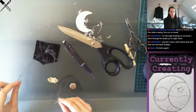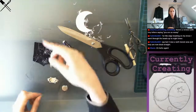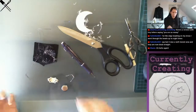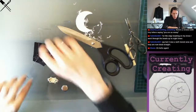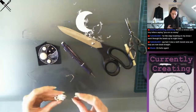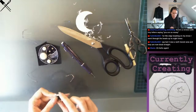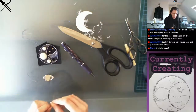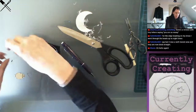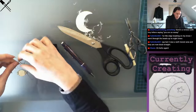So we have to go from the plus on the LED to the plus on the battery, through the LED, and then this goes on the resistor, and the resistor goes on the battery again, and that closes the circuit. I'm just going to confirm that I've got my pluses and minuses right before I screw this up. So in theory, the edge is the plus. So this is the plus on the battery. That goes there. This is the resistor. Actually, let's do it like this. Resistor goes there, minus goes there. Let's see if I just sort of vaguely hold this together, whether that will do anything.